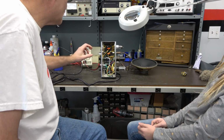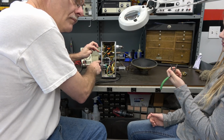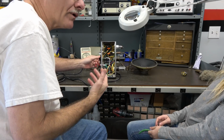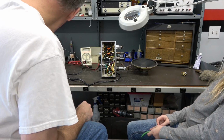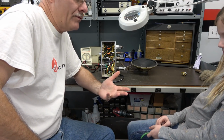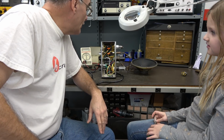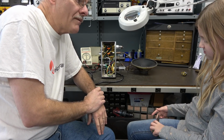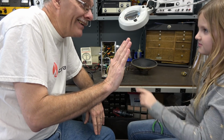Okay, I'm at 90 volts in. I'm gonna try the volume. So it's working. Okay. It's probably not working properly, but it is producing sound. It's a lot further ahead. Now the next step would be gut it, right? Yeah. So anyway, I'm gonna buzz out some other voltages and see what else is going on, but I think there's some promise for this amp. High five. Thanks.